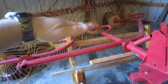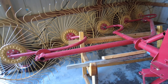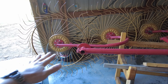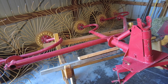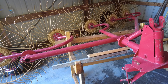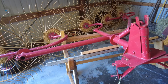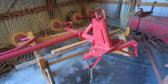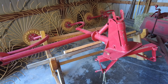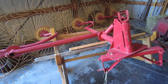The other thing is the tilt of these five wheels — you have to make sure they're all laying with the same amount of pressure on each wheel. It's really easy, especially with three-point hitch ones, to have the weight tip on the front wheel, which lifts that far outside wheel off the ground and leaves hay behind. Having all wheels consistently on the ground and at consistent pressure is important so you rake cleanly. Having float on your three-point hitch is also important — if you have hills or bumps you want the wheels to stay on the ground. If you don't have float, a three-point mounted wheel rake might be a challenge unless you have very flat fields.